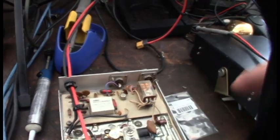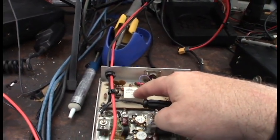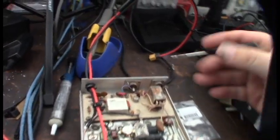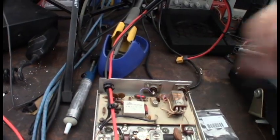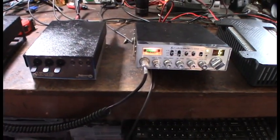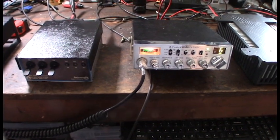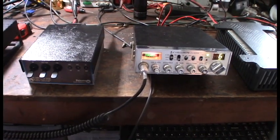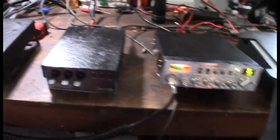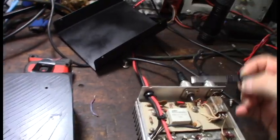It was all tied in and wrapped weirdly, so I'm going to replace that — the legs look broken. There's definitely something going on with the receive function. This would have to be working because when I power on the preamp it gets quieter. I feel like there's something wrong in the logic — some component going open circuit. The CB has been pretty active the last couple of days; I'm in southern California and picking up people from North Carolina, Florida, Georgia, Tennessee.